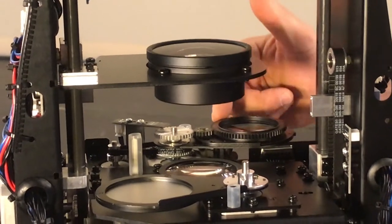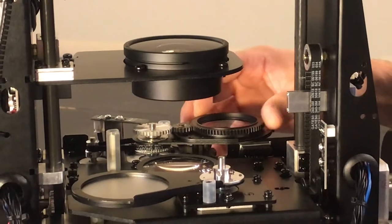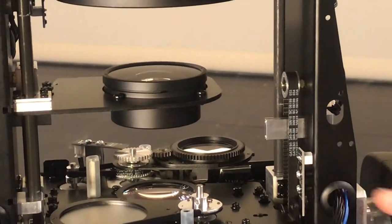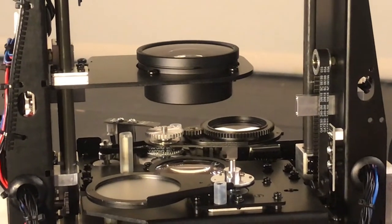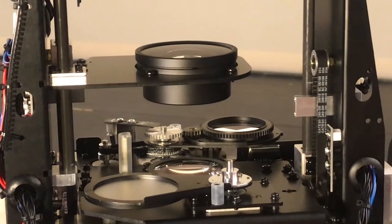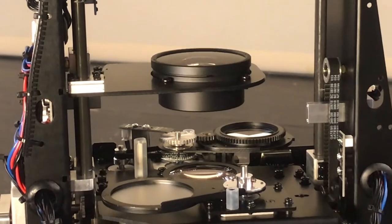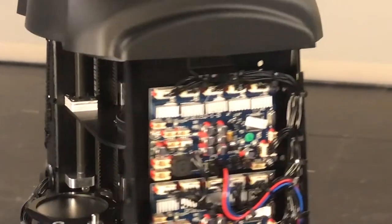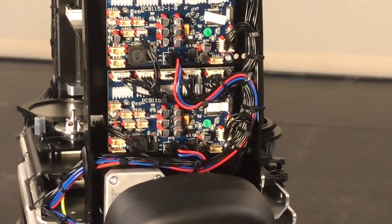Back here is a prism lens, and it can actually spin also. Once you put the prism into the light beam, if you have a gobo in, it looks like you get multiple gobos — it's a three-facet prism, so it looks like you have three gobos instead of just the one. And then on the side here is a control board to control all the different motors.